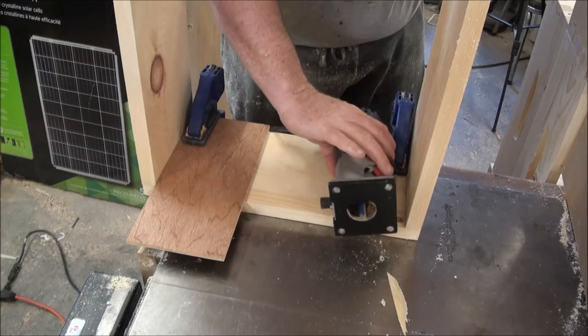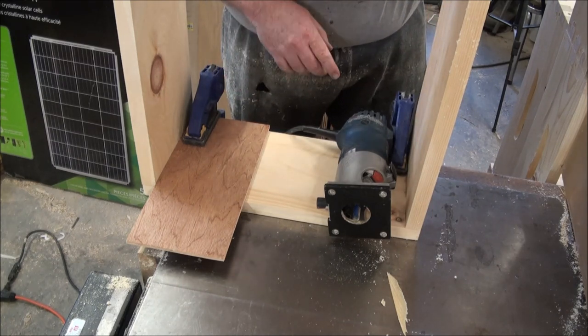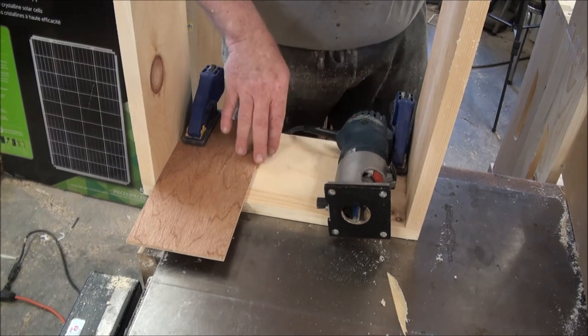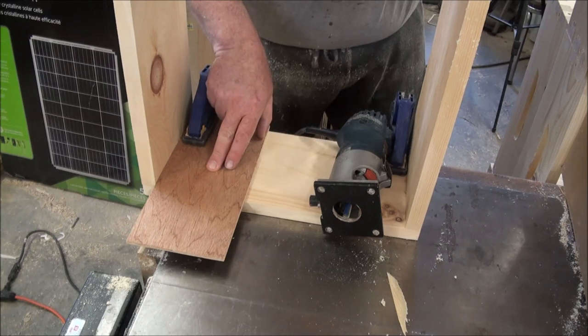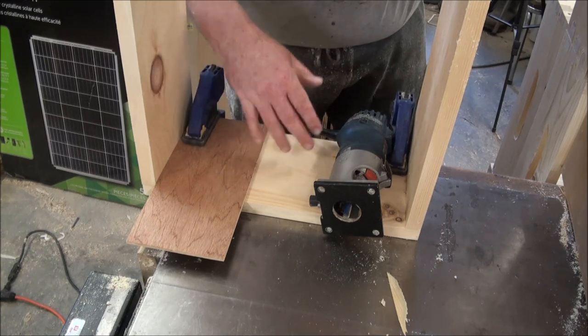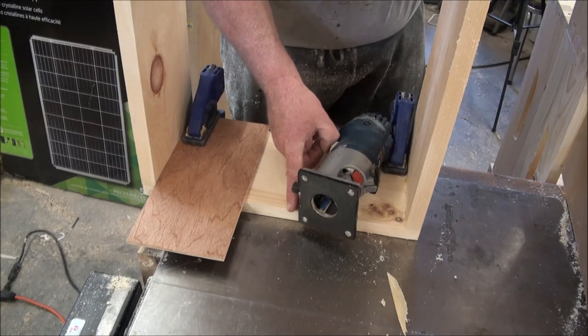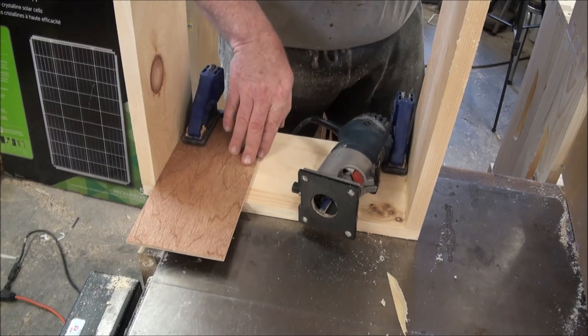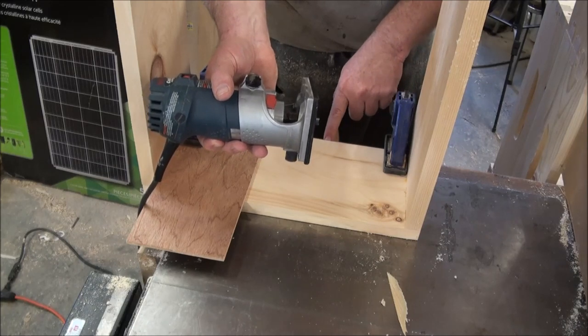That's all I'm doing today. I haven't been videoing all my work — it's just running boxes through the table saw, pretty boring stuff. It's nice to not be building frames today. I need to route a 3/8" dado on every side because I'm dividing it two ways to make four sections. So what I've done here is I've taken my 3/8" bit in my router, and because my plywood divider is going to be 3/8", I've cut spacers — one for the end and a different one for the side, the side one being larger. The spacer plus my router base to the center of my bit is equal to halfway between the two sides, so my dado will end up in the center. My depth on the bit is set to the exact same depth as the frame rest setback.